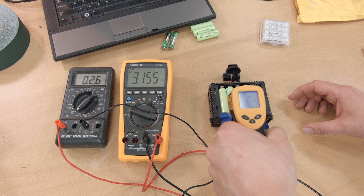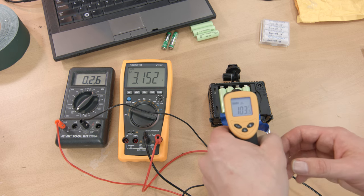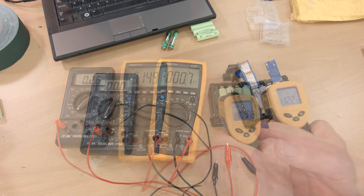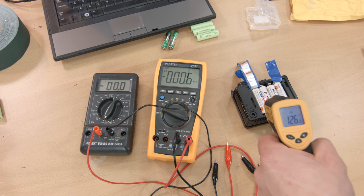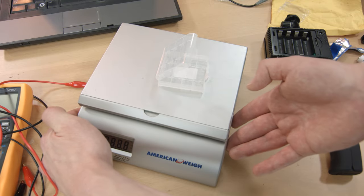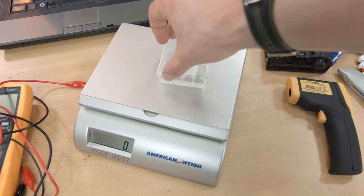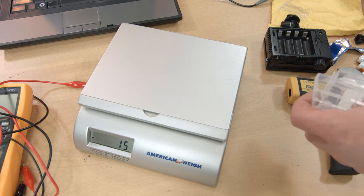After running the cells down, just for curiosity's sake, I checked their temperature with a probably inaccurate $13 thermometer. Let's call it 106 degrees Fahrenheit — about 41 degrees Celsius on average for the Chinese cells — and 123 degrees Fahrenheit, which is 50 degrees Celsius for the Eneloops. I said earlier that the random batteries felt very light — too light. After all, the more nickel and hydrides in the cell, the more energy it will hold and the more it will weigh.